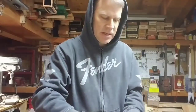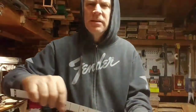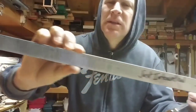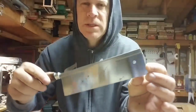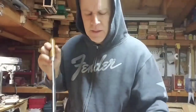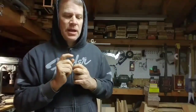I'm not going to go into detail about the fret slots, but I'll show you a couple of things. There are online templates you can buy if you want to get really exact. I also like templates you can print off the internet. What I did is I got a ruler and scratched the fret positions from my favorite guitar, then made an intonation template. You will need one of these specific saws with a .023 kerf. I use this trusty little miter guide to keep the saw exactly up and down. I also have another video that shows a precise way to do slots, depths, and everything.